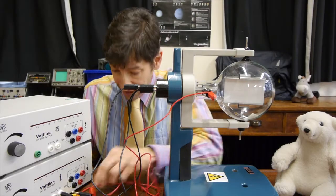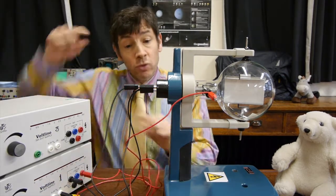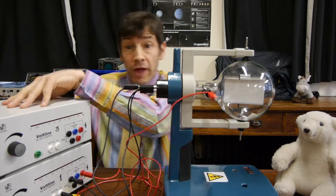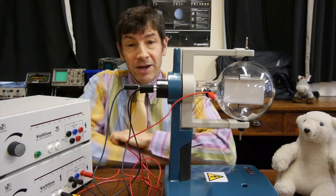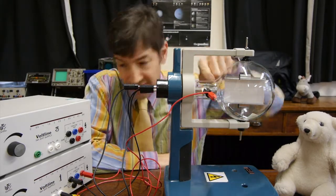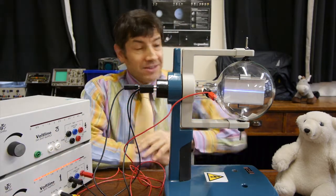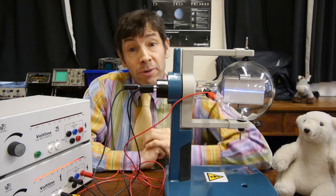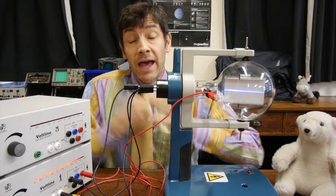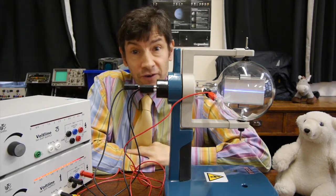So what we need to do now is to see the electron beam. Let's connect the anode back up and the cathode — the minus — to the filament. Let's turn on just the filament current, and now for the fun bit: let's take those electrons and accelerate them through 5000 volts. And there you go — you see this lovely blue stripe across the screen. That's electrons hitting a fluorescent screen, and as they hit it, they lose kinetic energy and give out photons of light.